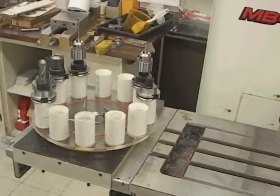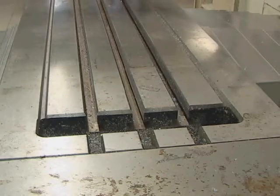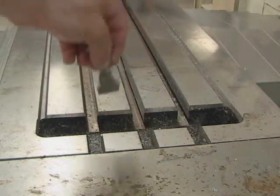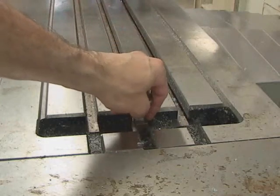The table of the machine is large — it moves about 30 inches left and right and approximately 20 inches in and out. It has three slots mounted on it. A carousel built by Walter will hold our tools, and here are the three T-slots in the table. They are actually inverted T's, and things called T-nuts can be slid into these slots to hold various things down.